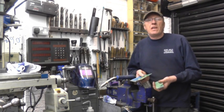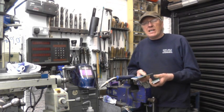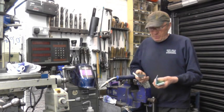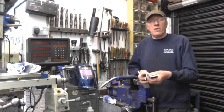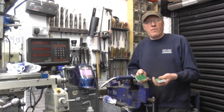What I've found welding the aluminium is the aluminium must be clean. Not quite as clinically clean as it needs to be for TIG, but it's got to be clean. This stuff here, a scrub with a wire brush is sufficient. The bits with plastic coating on, rub them with a little bit of acetone just to take any residue off the glue.